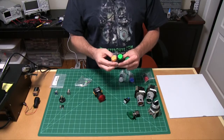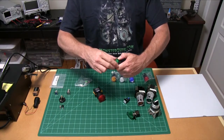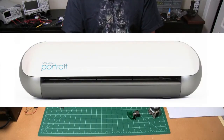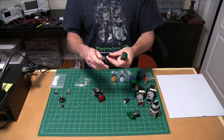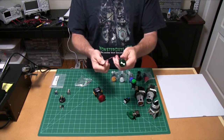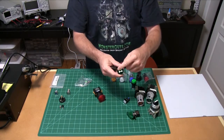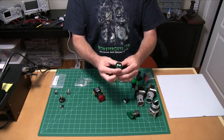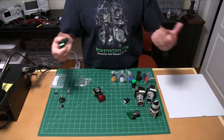These are panel lights — you can find them at automotive supply stores, on eBay, or Amazon. The lenses actually unscrew and I was thinking I'd make some labels for these as well. I got a new vinyl cutter that prints like a printer, so I was going to make custom labels. I just masked one off with some black electrical tape as a proof of concept using a 9-volt battery — these are 12 volts — and the concept works. I can make a vinyl mask, remove the label shape, place the vinyl sticker on the white piece, and screw it back on to create a cool symbol, much more interesting than just plain green status lights.